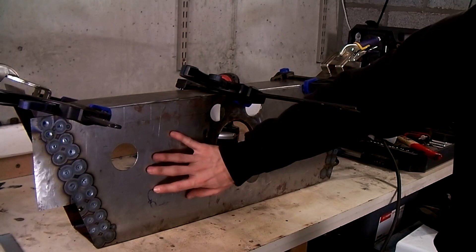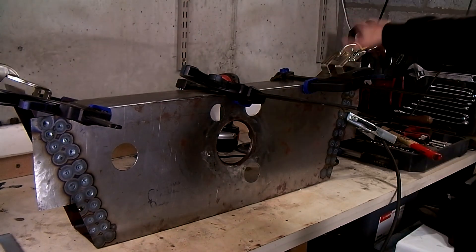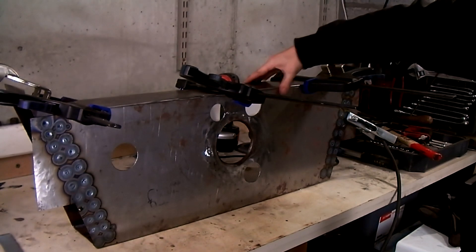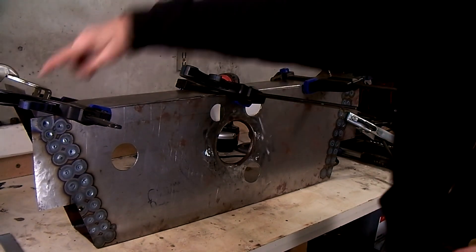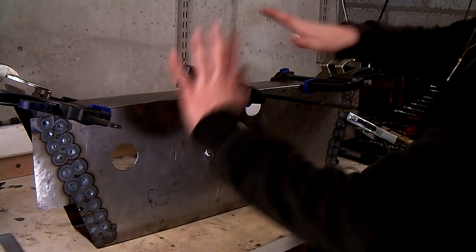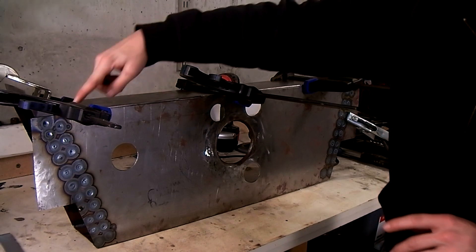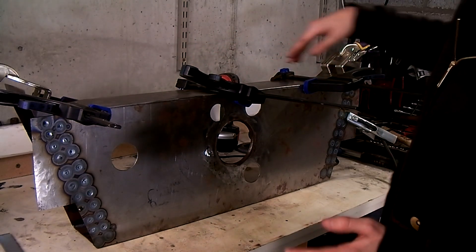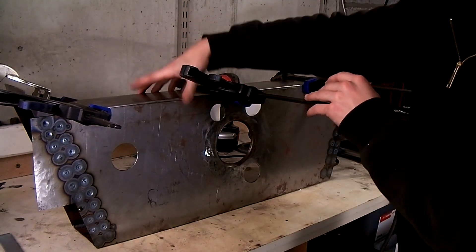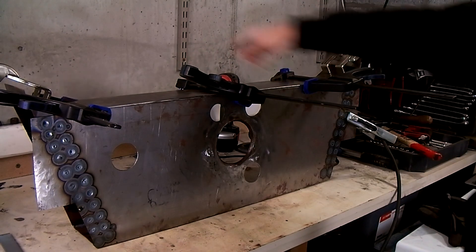I've finished spot welding both side pieces on this front part. The next panel we're adding is the top section — a flat section with two winglets and two folded edges. I'm going to tack this top piece to this rear plate every couple of inches, and afterwards I'll spot weld the winglets to the side pieces. I've clamped this because this panel had warped a little bit with welding. This will be a lap weld and I'll completely seam weld it, but I'm going to wait because adding more panels will create a very stiff structure that won't warp. So I'll just tack it now and seam weld the lap weld afterwards.